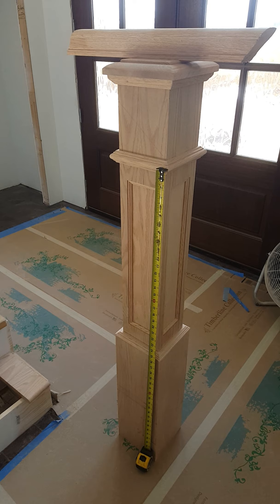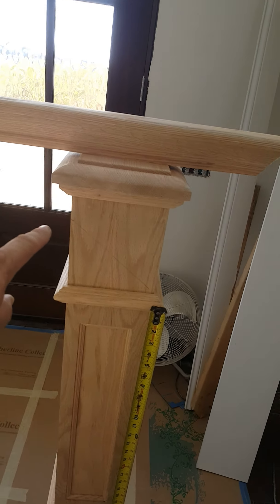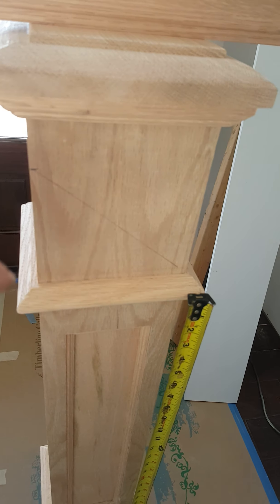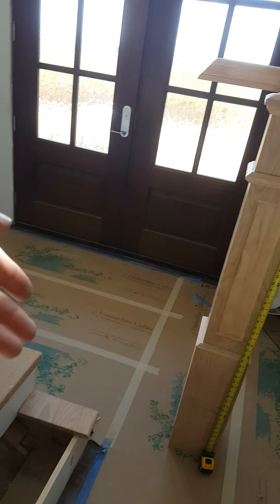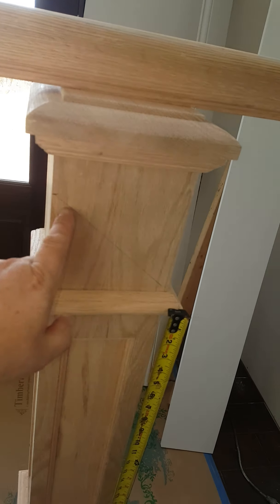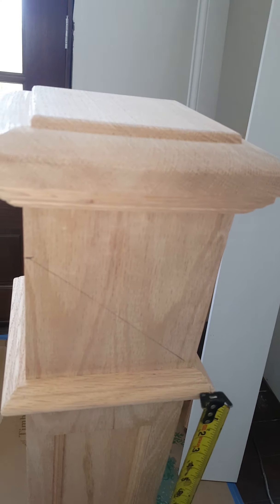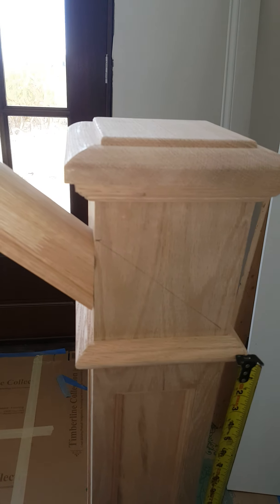The main thing is that I want my handrail — I've got a sample piece here — I want it to hit in the center of this blank right here. I've taken the angle of the steps, the rake of the steps, with a bevel square and transferred it over here. That line runs through and represents the top of the handrail, because I want the handrail centered at the top.